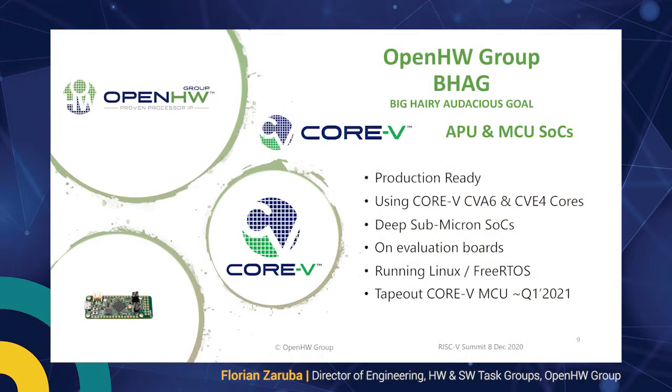And so just to give you a notion how this is useful, imagine you are prototyping your own custom accelerator for your AI or ML applications. You test this on the FPGA, so on the Genesys 2 board. You have plenty of opportunities to refine, test, and so on. But even when the ASIC version with the eFPGA comes out, you have the opportunity to have the same framework, the same Core 5 MCU framework, but you can put your own custom accelerators within the eFPGA fabric of the Core 5 MCU.